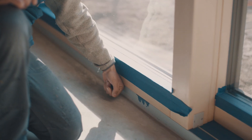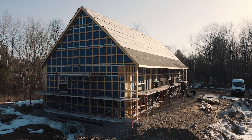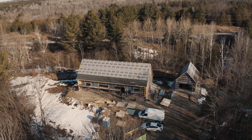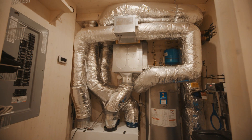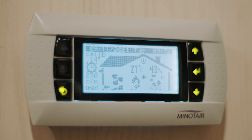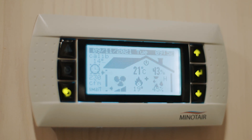When we're building a house this airtight we get a lot of pushback — people always think houses need to breathe. Well no, houses don't need to breathe; human beings need to breathe. When we build a house this airtight it's now in our control. We do an HRV, and through that HRV we can control humidity, air filtration, and we're getting much cleaner air. Whereas with more air leakage, that goes through a wall system that can be much more susceptible to mold, and the air quality is much poorer.